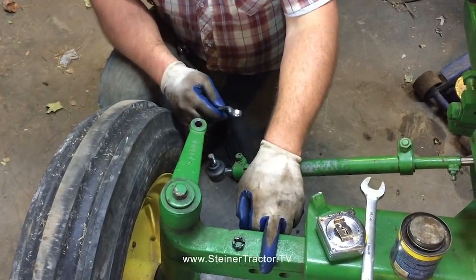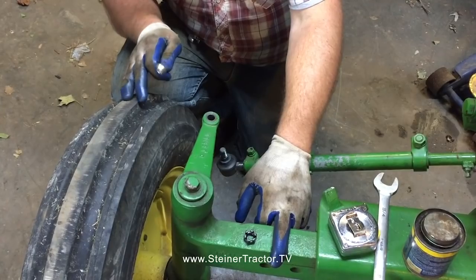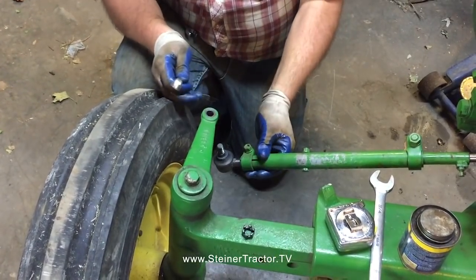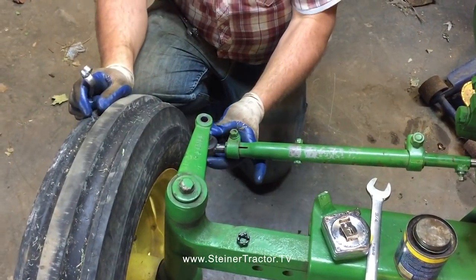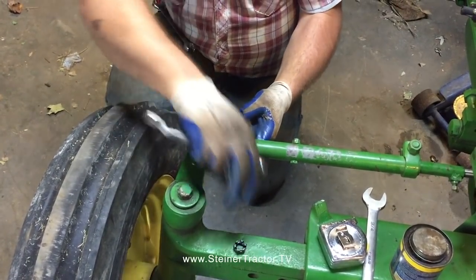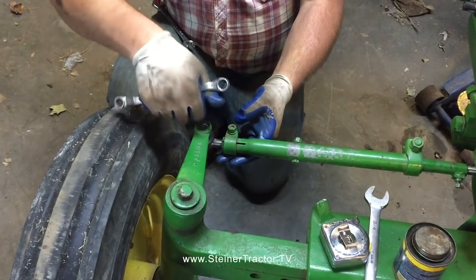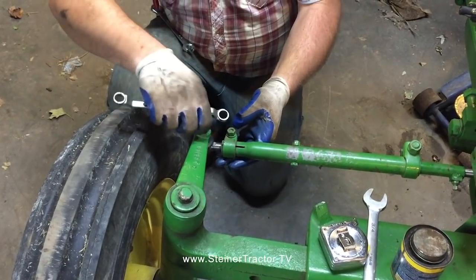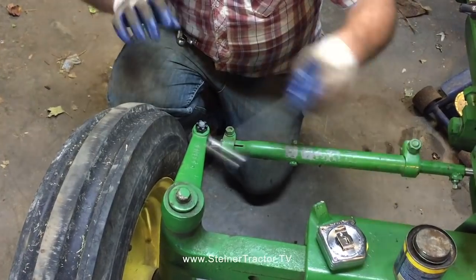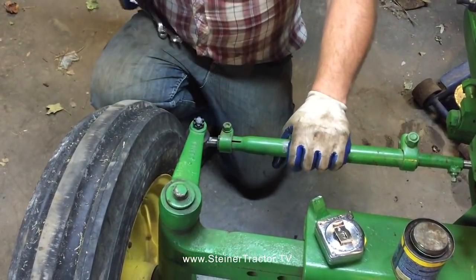It probably would have worked, but at 3/4 inch toe in, we may start to notice excessive wear on the ribs of our front tires. So what I'm going to try is shortening the tie rods. By shortening the tie rods, I minimize the toe in the front. I basically bring the back wheels together more than the rest. So we're going to try this and see where we're at. I still have to do the other side.